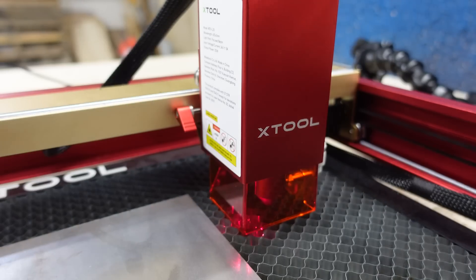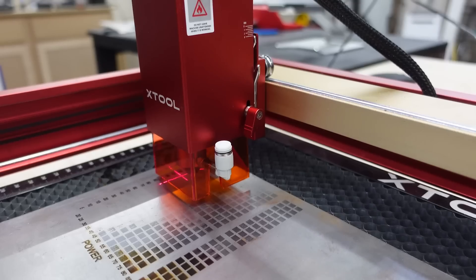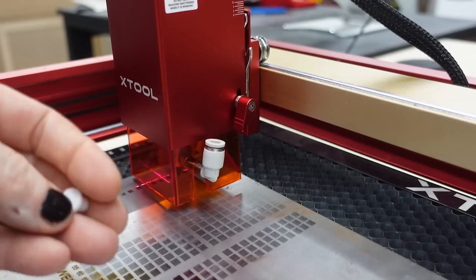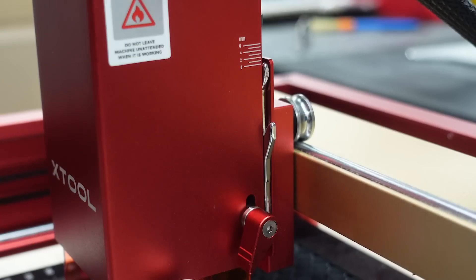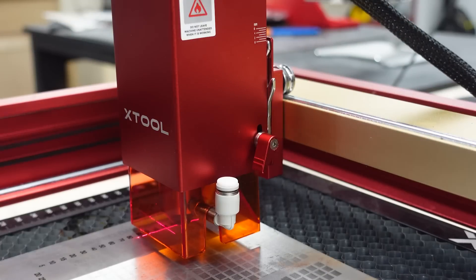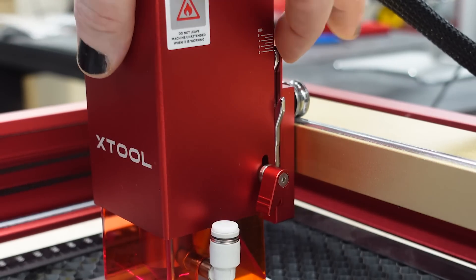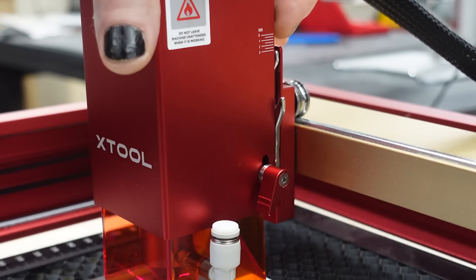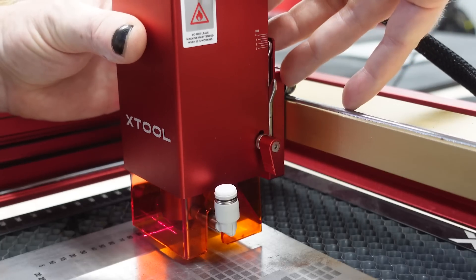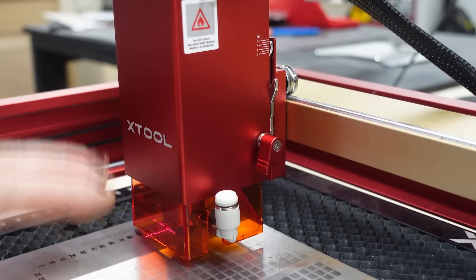Next up, let's take a look at the laser head itself. We have the updated lever switch here that just goes up and then you can manually move this up and down. You've got your capped-off air assist — if you're not using it, you can just pull the line and there's a little cap that goes on there. This guy is still your focusing billet, works the same as it always has. This little dial here — once you start getting into thicker material, if you want to cut through like a 10 millimeter piece, you want to go to five. So we're on zero, but you can move this all the way up to five, flip it back, and now you know you're focused for 10 millimeter material.